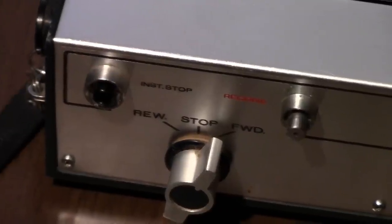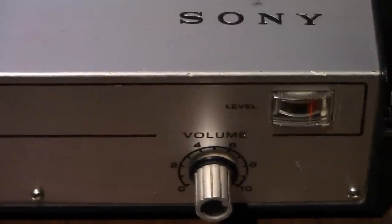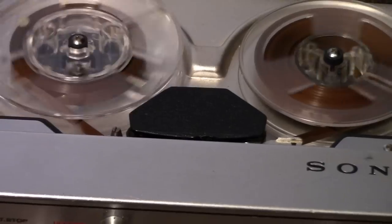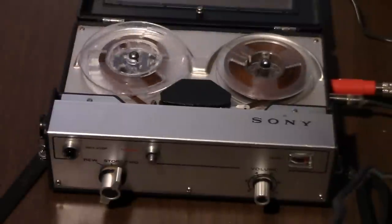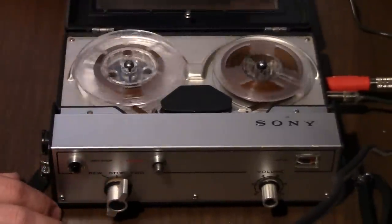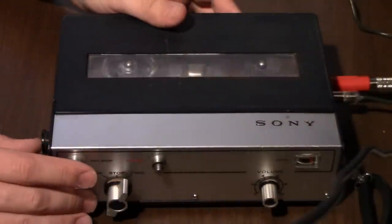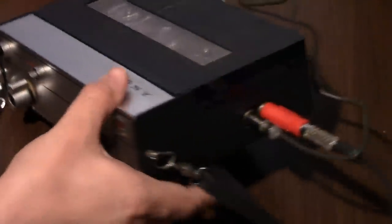And this recorder itself, excluding the SSA-905 docking station, just the TC-905, or tape recorder 905, which I believe is what TC stands for in Sony's model numbers, only uses 4 transistors. The amplifier uses 3 transistors. The bias oscillator uses 1. Then the SSA-905 uses an additional 3 transistors, that is one driving transistor and then a push-pull pair to drive the internal oval speaker.